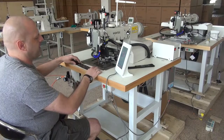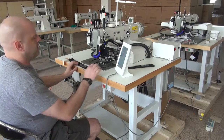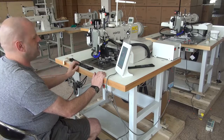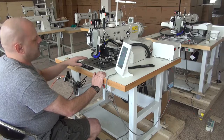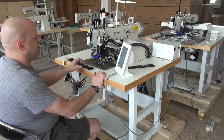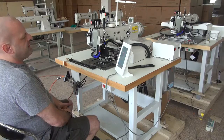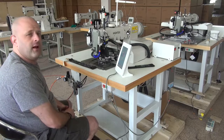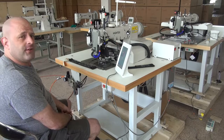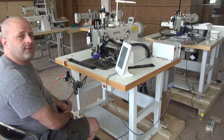Always make sure at the end of every sample cycle that you pull the piece out, and if you're shutting the machine off, allow it to resume — allow it to take the piece out of the work so that when the needle cycles up and down it doesn't go through your particular sample. This has been a demonstration video on the 7273PLK Computerized Automatic Pattern Sewing Machine. My name is Ryan Neal from the USA offices of Neal's Saddlery and Harness Cowboy Sewing Machines and Hi-Tech Sewing Machines. Thank you for your time today.